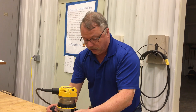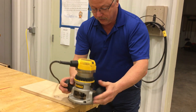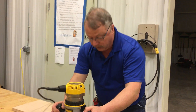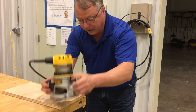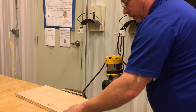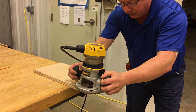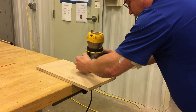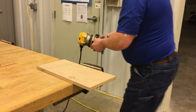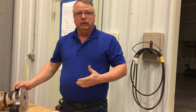When they go to the left, they're chattering. So what I do is I have the students go to and fro on all their cuts. If they're cutting across here, they're going this way, then back that way. Then when they come around the corner, I haven't turned their body, so they will be coming this way and then turning and going that way and back. It just seems like they have more control over the router when they're pushing away from the body and pulling back.